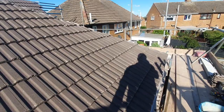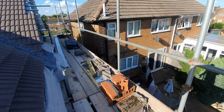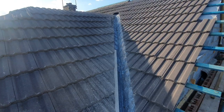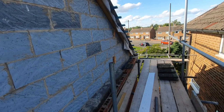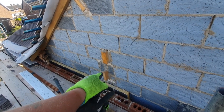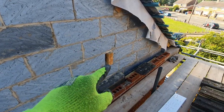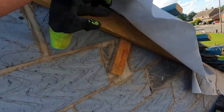If we go around this side — hopefully we'll be out of the wind down here. There's the other hip valley; it looks a bit better, that one. I'm yet to finish the pike end wall, but we've got the internal blockwork up and we've got the purlins poking through. That's a joist carrying the ceiling joists for support, but that's a purlin — the purlins are up here on the roof. Not purlin and binder — the purlins are the ones on the roof, that's right.